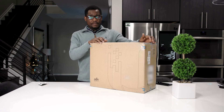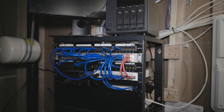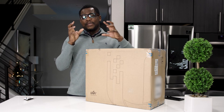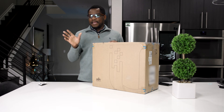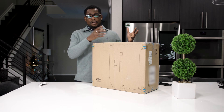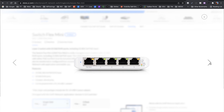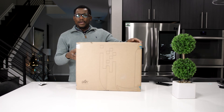The third reason is that I needed extra ports. My current switch is a 24-port PoE and I need more, so the eight ports on this device will be very helpful. The good thing is that all eight ports have PoE, so I can move some PoE devices to this UDM Pro SE and I don't have to buy any other switch. I was seriously considering getting the USW 48-port — the business one that runs about a thousand dollars — but with this device and a couple of UniFi Minis, it'll do the work.